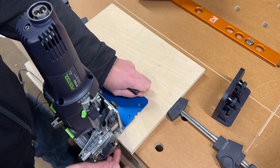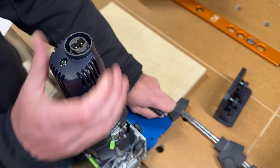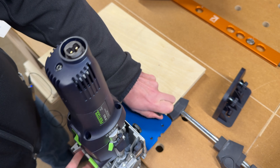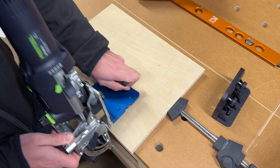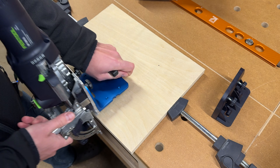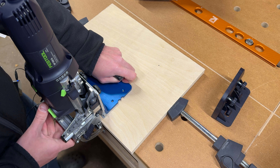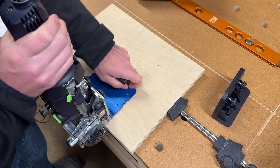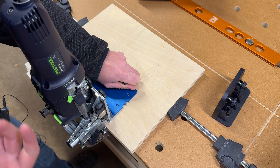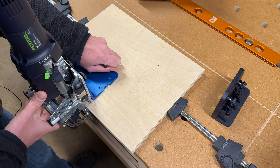In the limited time I've had my Domino, I like to reference from the plate itself. What's awesome about this is I've got registration and I can plunge down. Right now I'm not holding the Domino itself — I'm just holding the TSO Bigfoot. The stability you get from this also allows you to know that you're getting an absolutely square cut into that space. Without it, sometimes I found rockiness and didn't know if I was getting a perpendicular cut to the workpiece. Being able to put all the support for the tool on that T-handle and then plunge down just makes this an absolute dream to use.